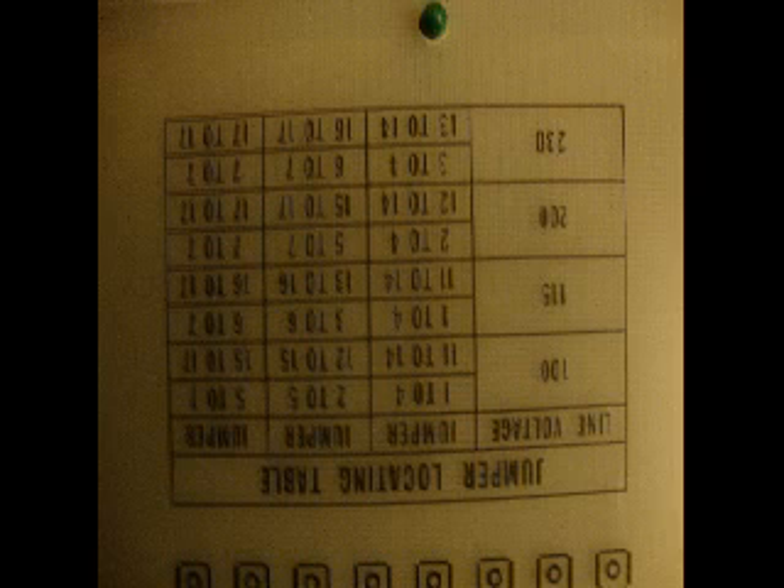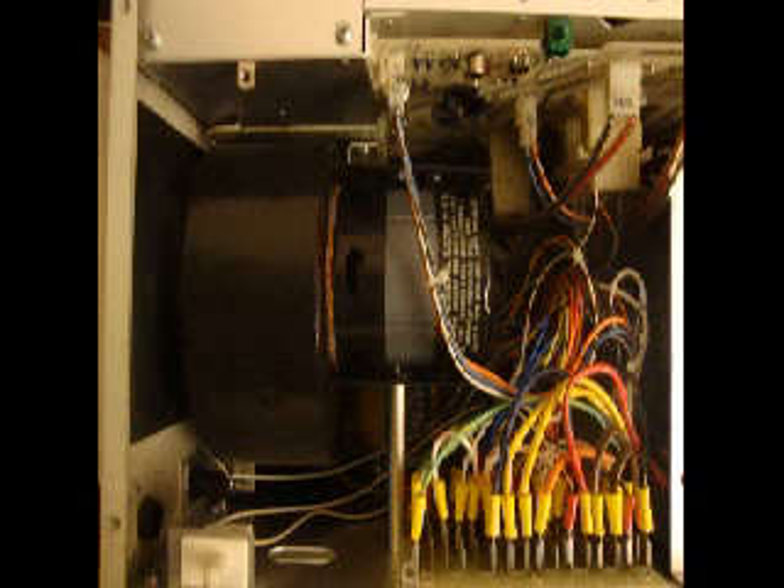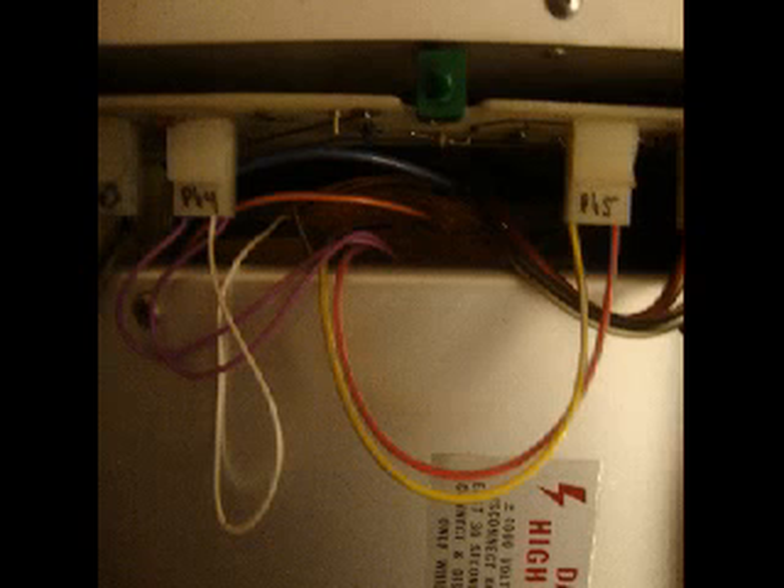It did have a little bent handles but I straightened out the problem. My wife weighs less than this device. The frequency response is rated to 100 kilohertz, and the manual also states it can work to 1 megahertz. It mentions up to 10 megahertz with less than 3% distortion, and I actually drove it to 77 megahertz without any problems.